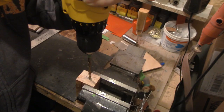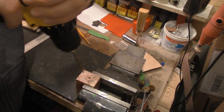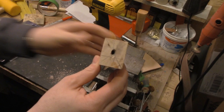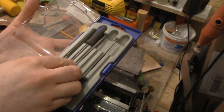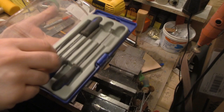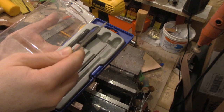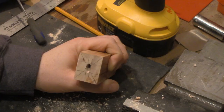I have my spot marked to drill the hole. Now I'm going to turn to some of my favorite little tools — these are little hand wood rasps and they work really, really well. I used to use just these little files here, and they work great as you saw for filing the bolster, but they're pretty fine and don't take down a lot of material. I was able to find these online — I think I got them on eBay — just a cheap little tool but they work really well. I'll begin using them now to make the hole bigger so the tang will fit through.